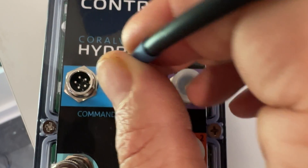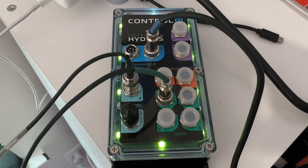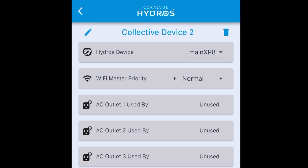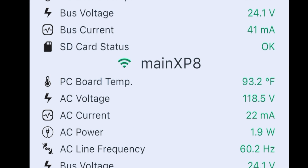At first I was like, wait — I want to just be able to plug something in, connect the command bus cable, add it in the app, and go. Coralview says no, don't do that — you could potentially fry something; you need to power everything down. So I followed their advice, powered the whole thing down, quickly added the XP8, and powered it back up. Then I connected the command bus cable between the X4 and the XP8, powered up the XP8, and now the X4 is getting power from the XP8. I wait for everything to initialize and get the blue status lights on the XP8 and the X4. Then I go into the Hydros app, select the collective to see its status, add the XP8 by going to Devices, hit the plus symbol, select the XP8, and leave Wi-Fi at its normal settings — meaning the XP8 Wi-Fi controller will only try to connect to Wi-Fi if the X4 is disconnected. Tap 'Upload Changes,' wait for the Hydros to do its thing, and then confirm the XP8 is added to the collective by noticing the XP8 is no longer in the devices list — it's instead on the collective status screen.